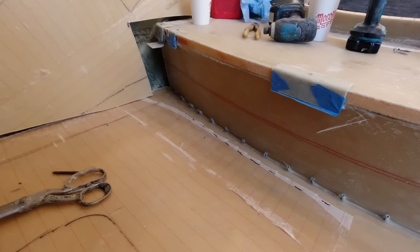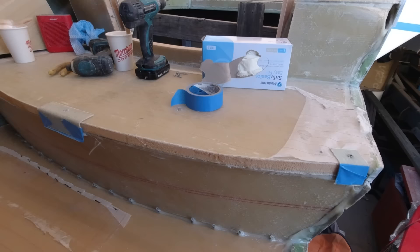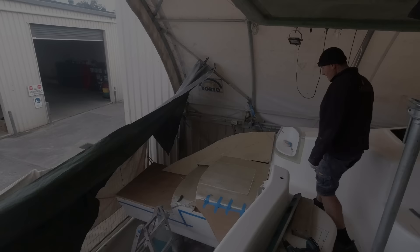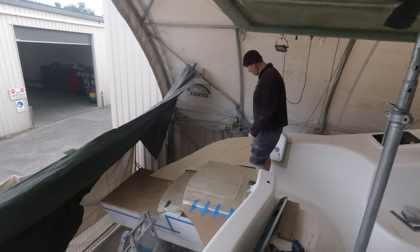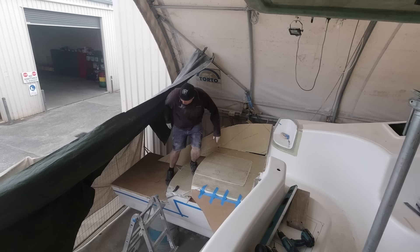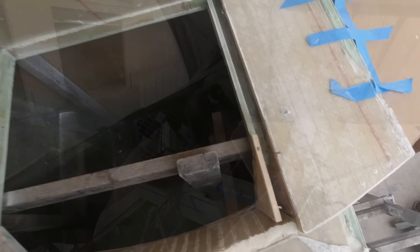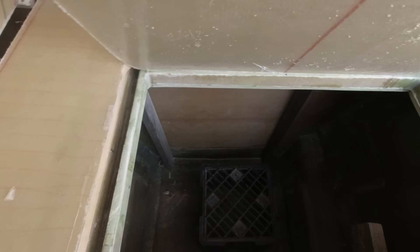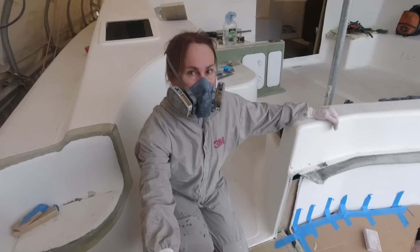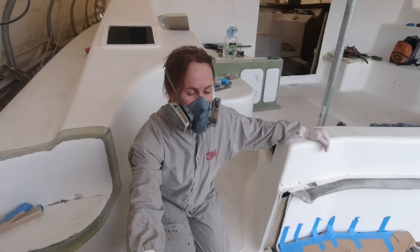It's in — that was a messy job. I'm not quite finished; I'm going to go in underneath and push it out at the top. I've had a bit of a problem getting it to shape — there might need to be a big screw or button screw through it to hold it in place. I haven't been able to actually walk on this yet, it's still all braced, but I can get a feel for the back steps and can even stand on the bulkhead. The drainage is all formed — it's going to work a treat. All the water will run down onto this step and out over the back of the boat, so no water back onto the deck.